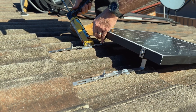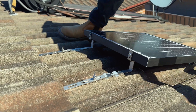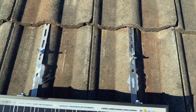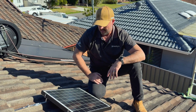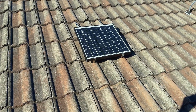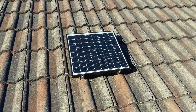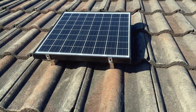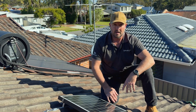Just put a little bit of silicone on both top ones only. Once that sets it stiffens the whole thing up a little bit more. So that's a pretty nice tile bracket installation — pretty straightforward. Different profile tiles are a little bit different but pretty much the same method. Now we're going to get into the roof and start connecting up the lights.